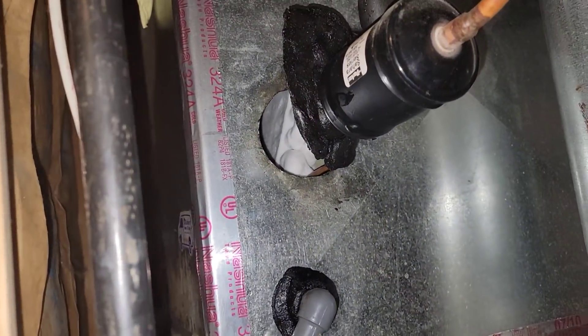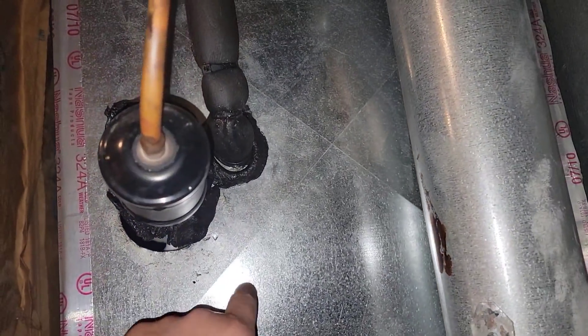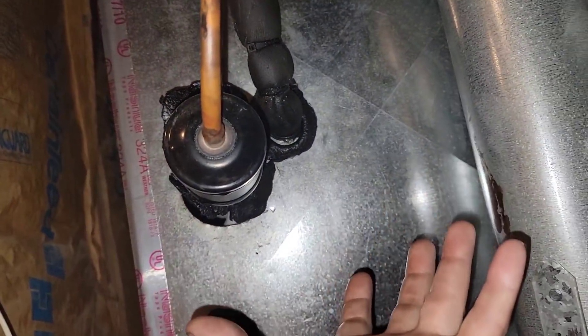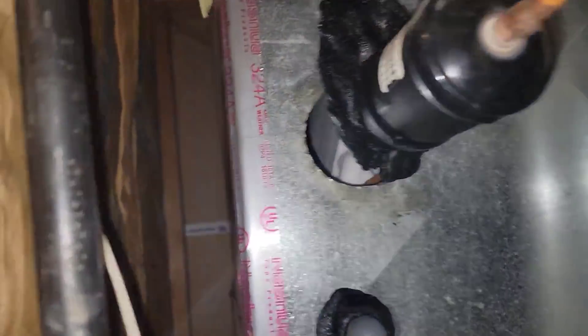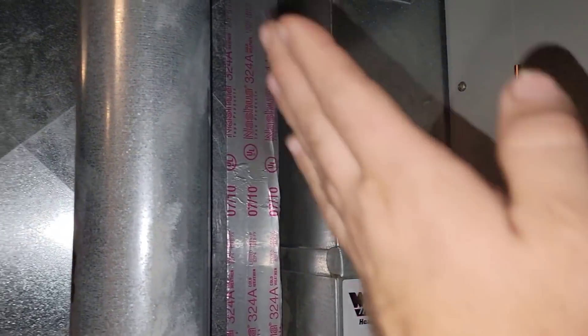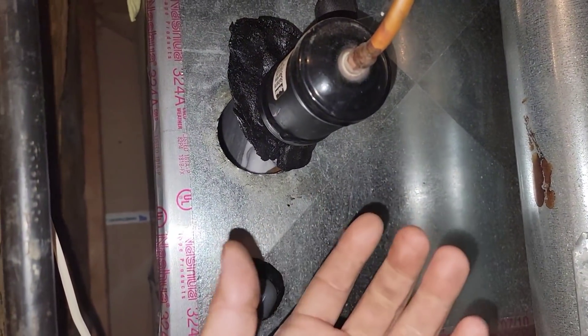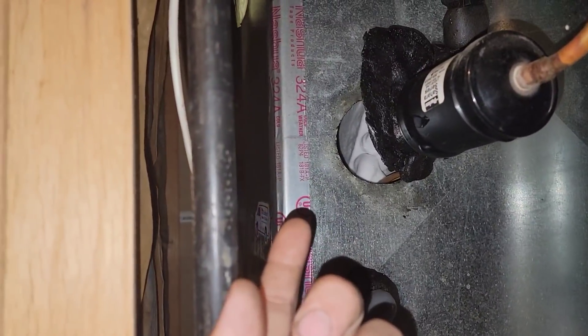Last time this happened down in Louisiana, I had to get access to the inside of the box. Once I pulled back this panel I was able to clean all the debris inside. The evaporator is a V-shape — there was all kinds of debris in the center that was plugging everything up and causing it to freeze.